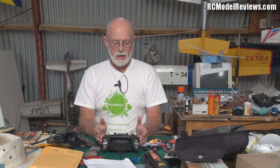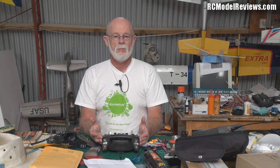Dragon Link have said they're sending me a unit to review, so it'll be interesting to see the comparison. The other thing to remember with the R/C Mile system is it's spitting out a lot of energy in harmonics. Even though it's supposedly 1.2 watts in the low power configuration, how much of that is actually on the frequencies you want versus harmonic energy? If you put it on a power meter it measures the whole lot - the actual power going to the antenna on the required frequency may be a lot less than the claimed 1.2 watts.